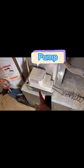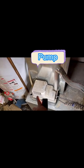The water goes down to the pump, and when the pump is full it pushes the water all the way to the sink. As I see it right now, there is a pad in here and it looks like the water is coming out here — this humidifier just ran again. I'm going to open this to find out exactly where the water is leaking from.